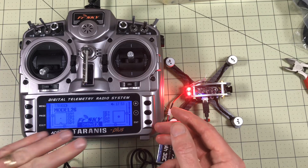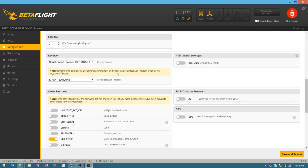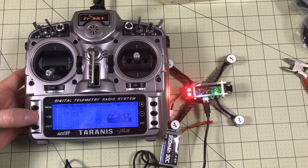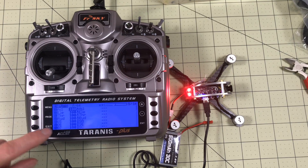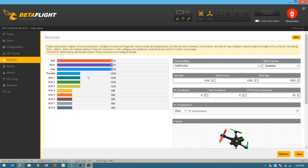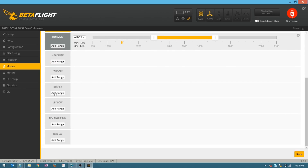I might be able to just change it and leave it that way so it doesn't mess up everything in the future. I set it up, rebound it, and then under Configuration I had to change the Spektrum type to Spektrum 2048 — and then that worked. Now under Receiver I have my throttle working, yaw is working, everything is working. It still says on the channel map TAER. I also went through and set up my normal inputs the exact same way — all my switches are in the right place, they all work properly. My arm and my modes from last time are all set up.